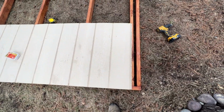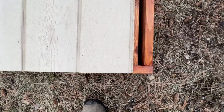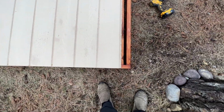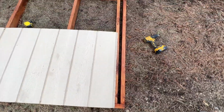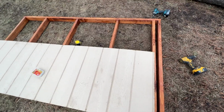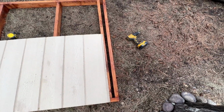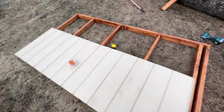And again, if you find something rolled, you don't need to do this extra board, but you can see how the two 48-inch sections stop there. So I'm gonna have to cut one more piece out here, overlap it by 4 inches, and that'll be that. But that's why you see this extra, why has he got two studs down that point? That's why. Okay, stopped snowing and it melted, so we're back at it.